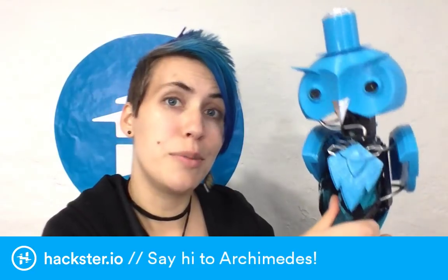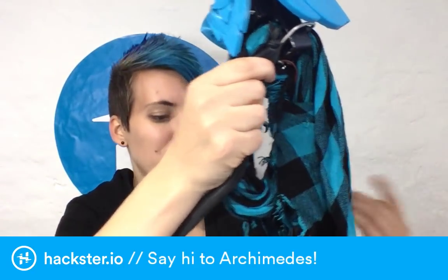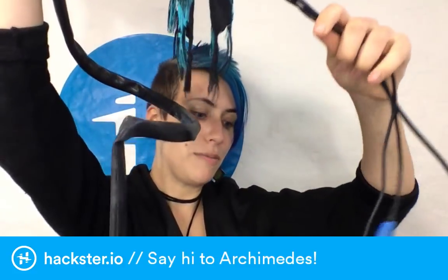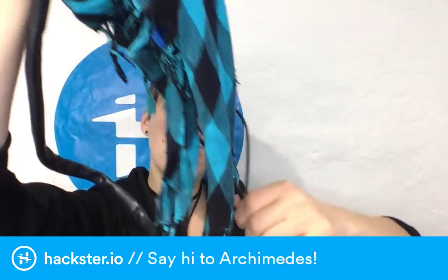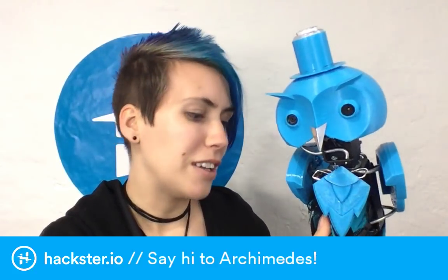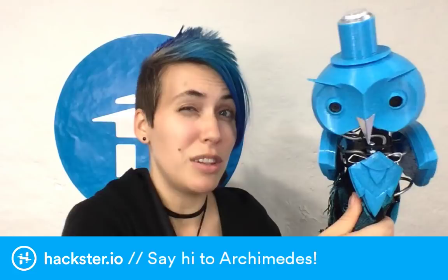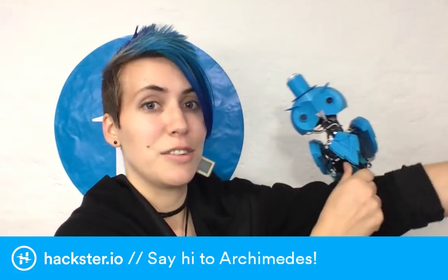And then I have an Arduino Maker 1000 back here in this tuft of scarf that also makes it comfortable to wear. There's 3 USB cables coming out of here. One of them powers the Arduino, one powers the Pi, and one powers the servos. However, I'd like to replace the one for the Arduino with just a LiPo battery, because it can run for pretty long on a beefy lithium polymer battery, and it's got a JST connector for that.